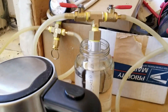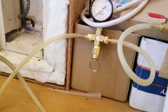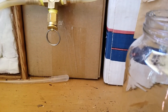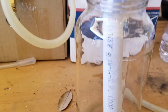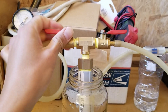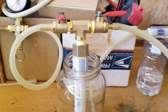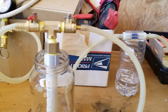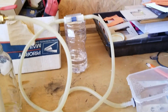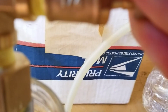I'm going to go and empty out this jar. This is boiling hot water, so that means it's at about 100 degrees Celsius, 200 degrees Fahrenheit. My plan now is to close the input valve and purge the lines — that's all the way closed. I need to purge this of all the hydrogen gas. The best way I know how is to just open this up, pull this hose off, and blow through it.